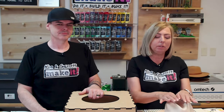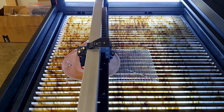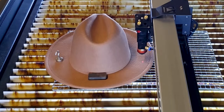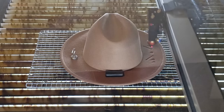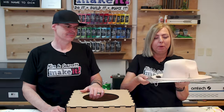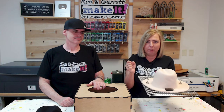Because you're using a two-and-a-half inch lens, you don't want the gantry to hit the top of the hat. If you lower the bed to the point where the gantry can go over the top of the hat, that's way more than a two-and-a-half inch distance. So with that lens, you'll need to engrave your images two-and-a-half inches from the top of the brim, which means engraving them separately all the way around — one at a time. The gantry will hit in the Y axis if you try to go all the way around, so you engrave one side, then turn it and engrave the next, and turn again to engrave the back.